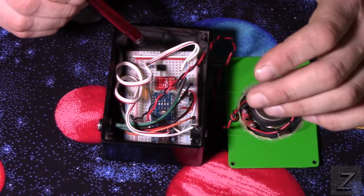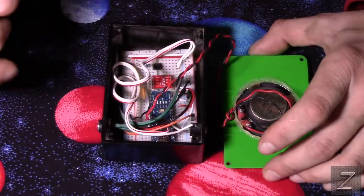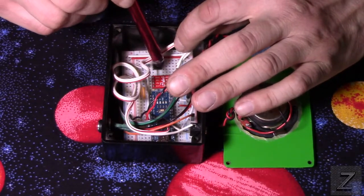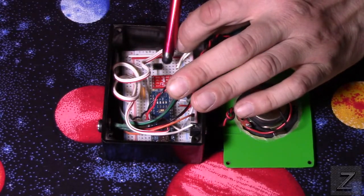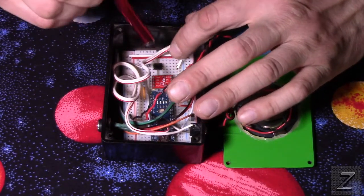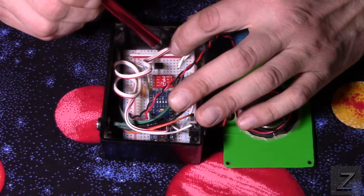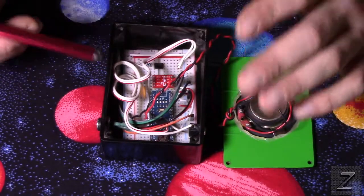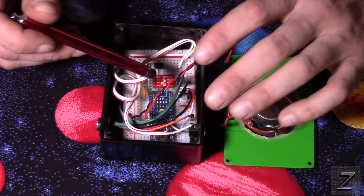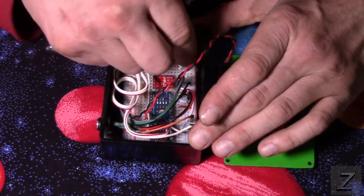What this does is it allows the connection to our camera to not be physically connected to this. There's a little infrared LED in there and a little infrared transistor, some people call them infrared diodes, and when that light turns on inside there, which you can't see, it's all inside this tiny chip, it lets the current flow through the other side, so there's no physical connection. You don't have to worry about frying your camera. It uses light to activate it, and you just have your two wires that come from the camera.